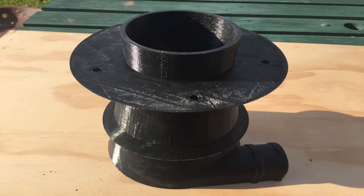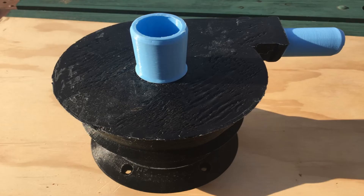With the three sections made, I glued them together. After the glue had dried I inserted the screw-in inserts. This project used about three quarters of a kilo of PLA using settings of 15% infill and 5 shells.